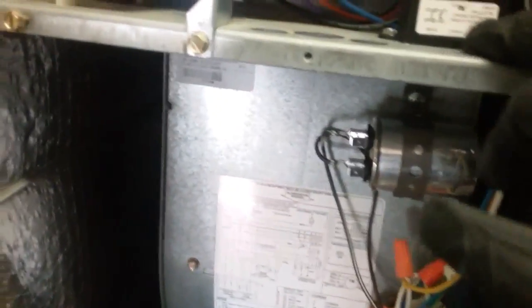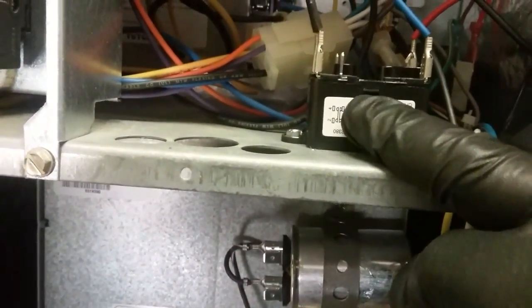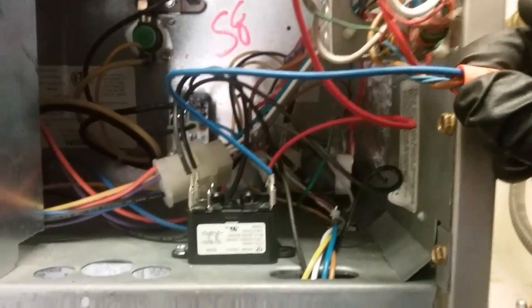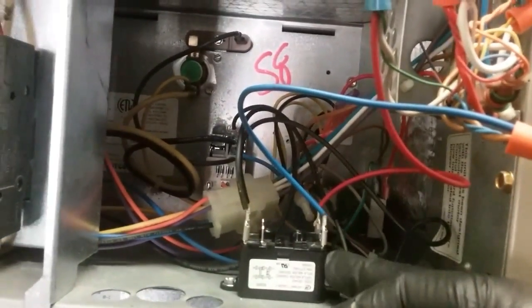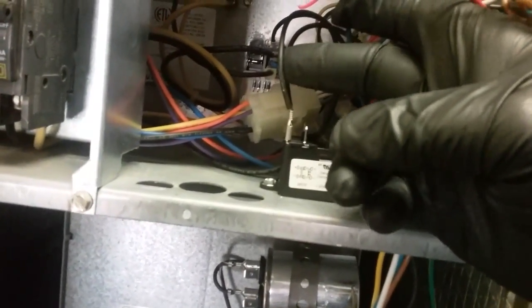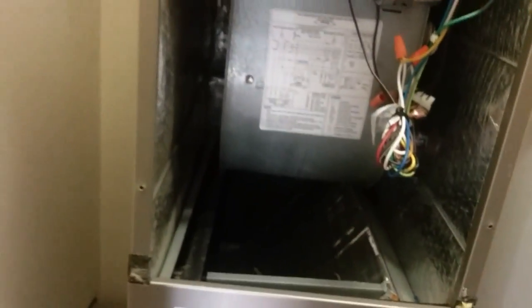It's all wired up. I got it running on high-speed tap. Here's the relay — I got it wired on normally open, which is terminals two and four on this relay. I got common over here to my thermostat, and I got 24 volts coming off of G — which is green — going to the other side of the coil on this relay. For line voltage I'm coming off right here, over to here, and when the circuit closes it's going to send power back over to the high-speed tap.